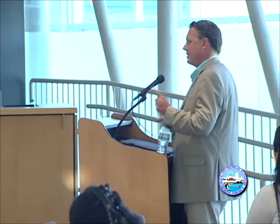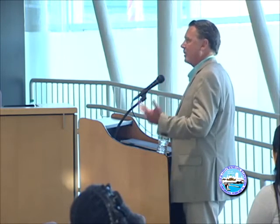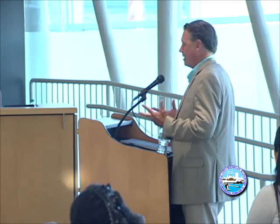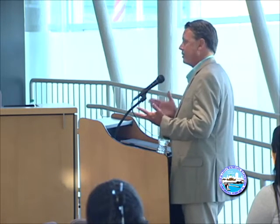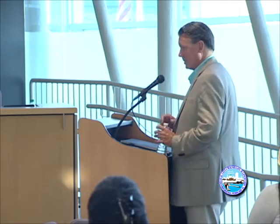And that can be something that's postponed until grants are available. It can be postponed until a developer expresses interest in the property. But the key is, we know with certainty if a developer comes in, here are the conditions we've left you. We've removed the building, we've removed the asbestos, we've removed the uncertainty except for these underground storage tank issues. The other good news on that property is no PCBs, no trichloroethylene solvent, only petroleum products are the major contaminant of concern, and that is a readily implementable cleanup. Low cost, haul it up to the landfill, dig it out, or put an engineered barrier over it as another building or another structure. Low cost solution to that problem.